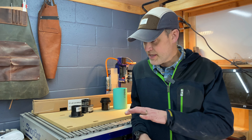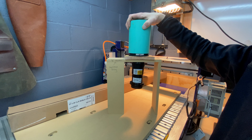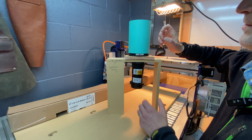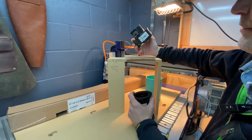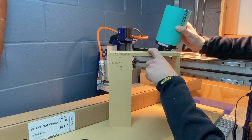I've got a couple of really simple pieces and parts, and I'd like to step you through how I'm going to do this. Let's take a look at how this all goes together by deconstructing a little model I built here. I have four-inch PVC pipe coming out of my dust collector — this will be a dedicated line for the ShopBot. To reduce from four-inch down to two-and-a-half-inch, I start with a reducer fitting.